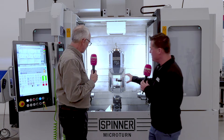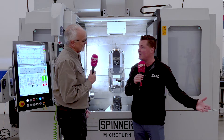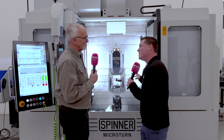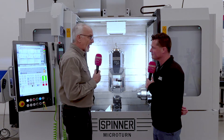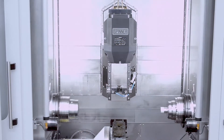Can we talk about what it means to be able to multitask? When we're talking about multiple machines previously in a lot of shops needing to do different operations — turning and milling — and then combining those, what are some of the benefits? Without having the necessity to have two or three machines running apart, you save all that queue time, all that potential for error when you're handling parts and loading parts, getting chips behind the parts. Where here, it hands the part off — you're doing milling, you're doing turning, you're doing all the things that you need to do in one machine.